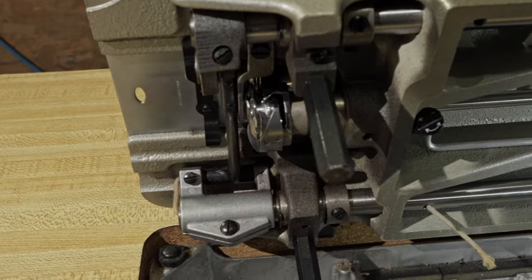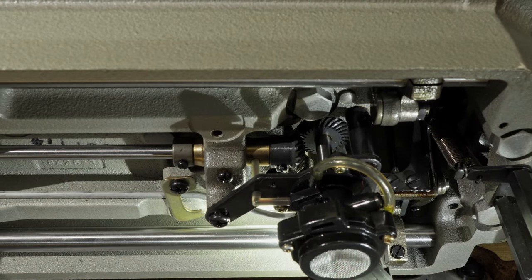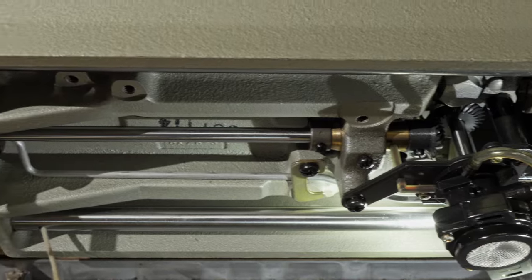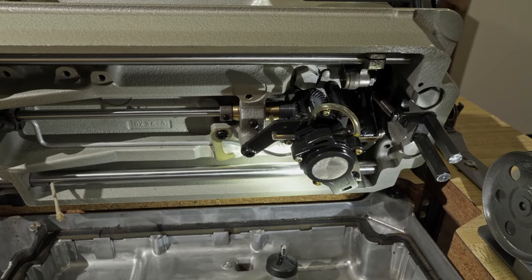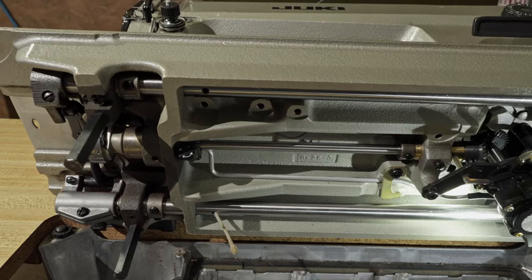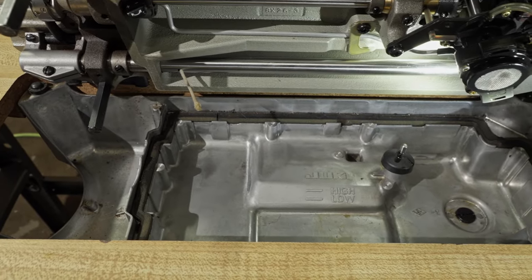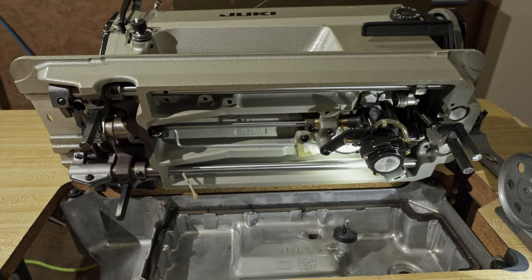You can see that there are no belts on the bottom side of this machine like the old Singer 111 W155 had. This is a shaft drive, a geared drive — more like a Singer 201 has — where it will drive the hook assembly with a metal shaft and a gear. And there's the oil sump — it's a self-oiling machine. The nice thing about these is the fact that the undersides are usually pretty darn clean, though sometimes there will be broken needles and thread in there that you'll have to clean out. I've already oiled the machine manually through the top with just a little handheld oiler.